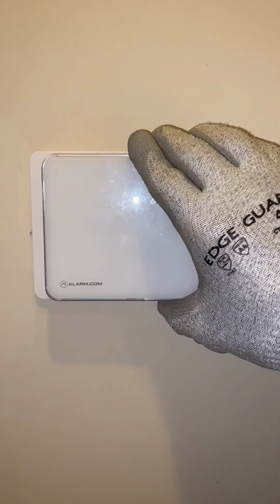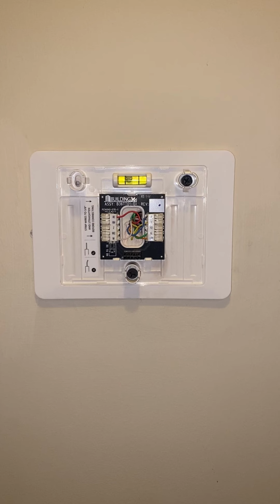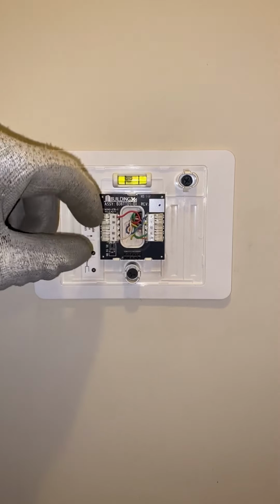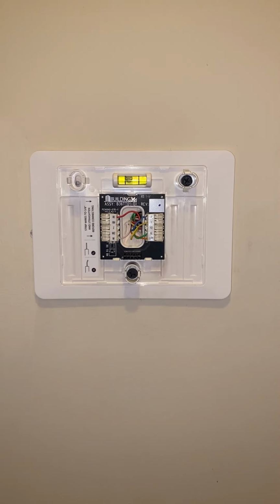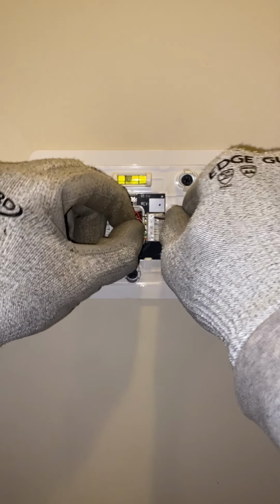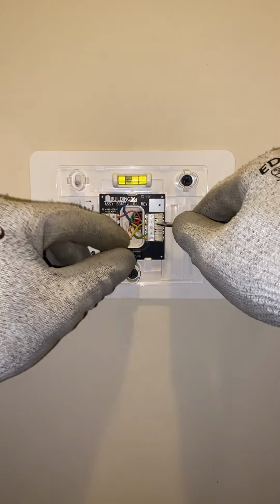All right, y'all, so this is the thermostat that they have here currently. It's a digital thermostat, but pretty basic. So let's go ahead and remove these wires. It'll be the same as upstairs. Power's still off. Let's get that low voltage. All right, so we're just gonna take our low voltage screwdriver and push these little prongs in right here.